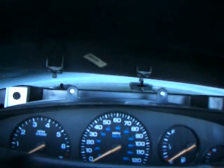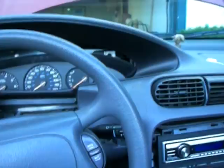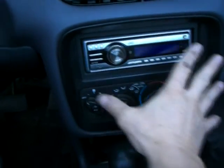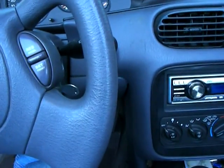Slide it past all your hanging paraphernalia hanging off your mirror. Now you can see the tabs, you can see where they go — slide right in there. You're just going to slide the whole dash cover right back in place. Once you get the dash in place, put the one screw back here under the fuse panel, put the four screws back in here, snap your face plate back in. I recommend trying to line up the two tabs at the top first — it seems to go in a lot easier that way. And be aware with all of these screws — you don't need to super tighten them, nothing's going anywhere. Just make sure they're seated well.